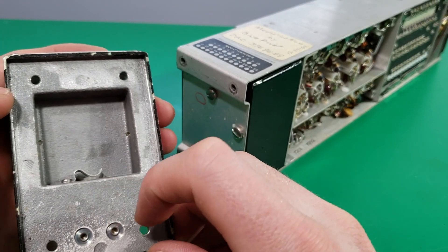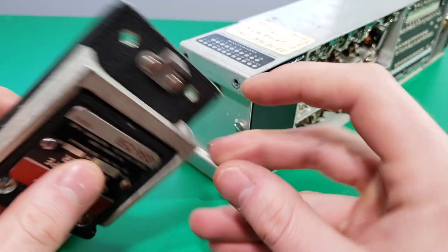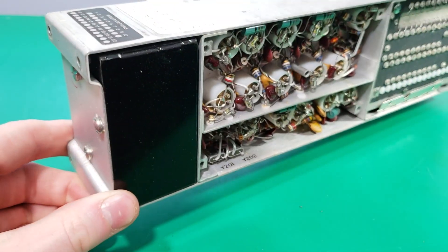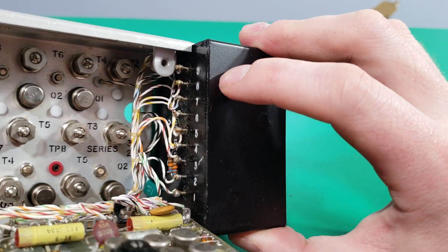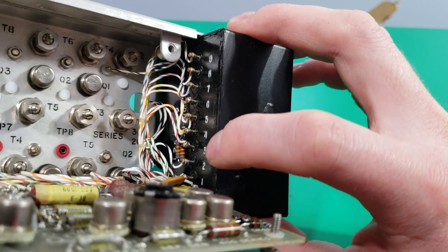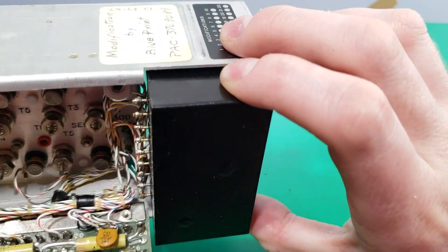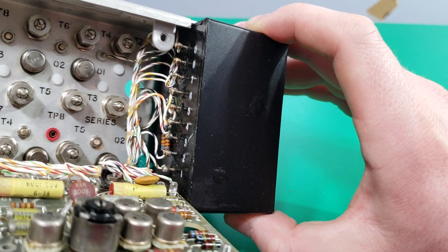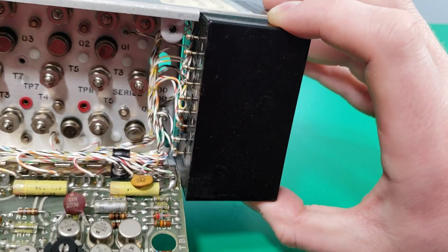Here's the front piece — it's a cast aluminum piece. You can see the little mechanism that keeps the handle from swinging out when you don't want it to. After removing three more screws, I can pull the transformer out a little bit but it doesn't want to come all the way out. You can see it has nine connections back here, so this transformer has a lot of different coils in it. There are some components back there and it's actually encased in a piece of metal — very rigid and tough-looking, going all the way around. I'm guessing that's to keep it from interfering with the rest of the circuitry. A significant portion of the weight of this device is just this transformer.